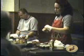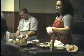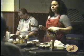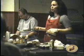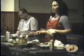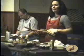You really need to wax your shellac. It won't take down your shine that much. You're not opposed to wax. One or two. Yeah. The more wax you put on, the more sheen you'll get. So maybe I would do 2 coats of wax on that shellac. Shellac is the most important thing to have wax on. You put a clear wax on it?